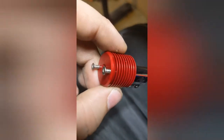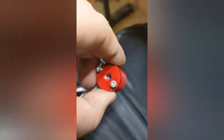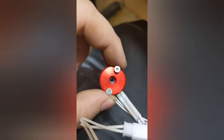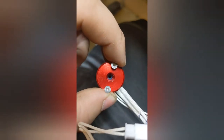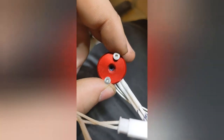There's the inside of the bore — as you can see, the inside is WS2 coated. That is a high-temperature non-stick coating similar to a high-temperature Teflon, but it can withstand up to 500°C plus, so it's not going to have issues. Let me go ahead and remove this little set screw to show you more about that.